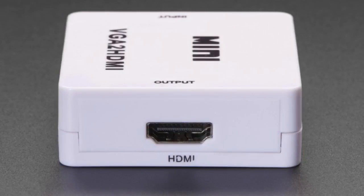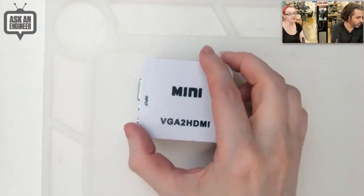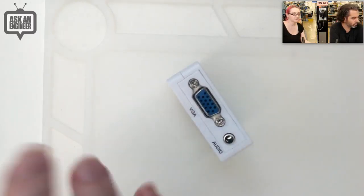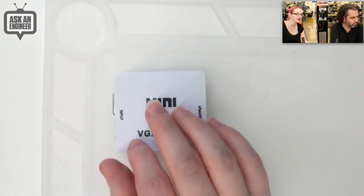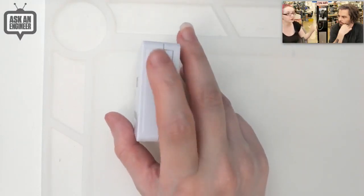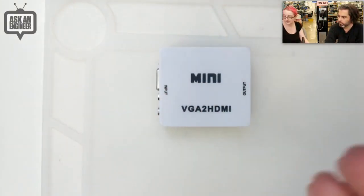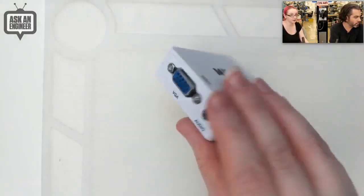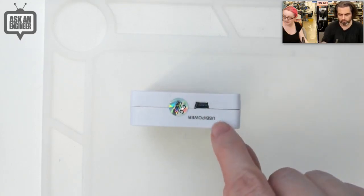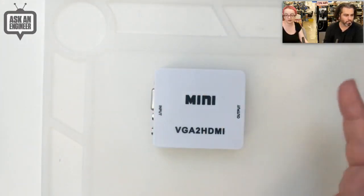This is a VGA to HDMI adapter. Sometimes if you have a computer or a device that has VGA output — and this can include microcontrollers. There are a lot of microcontrollers that can basically get VGA output with some filtering, because you have three analog outputs and H-sync and V-sync. So if you have an FPGA or a fast microcontroller generating VGA output, but you really want HDMI so you can connect it to your monitor, TV, or whatever — or you have an older computer with VGA output and want to connect it to something with HDMI — this is a converter. It's fairly low cost. You put audio in if you want to add audio into the HDMI, because remember, HDMI is AV — both audio and visual data. And there's USB power; use a mini USB plug or wall adapter.